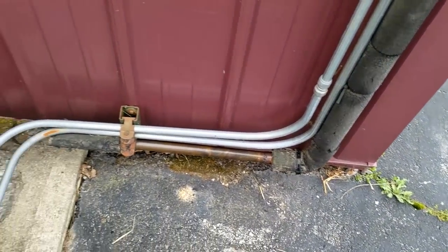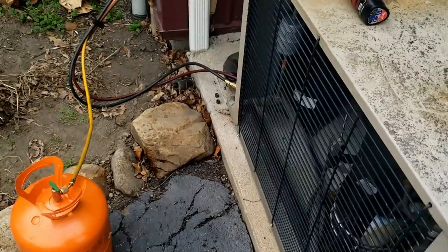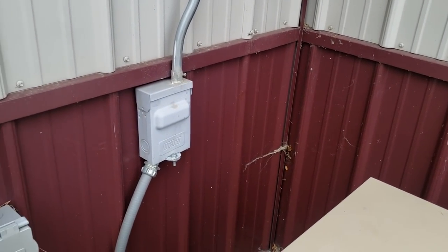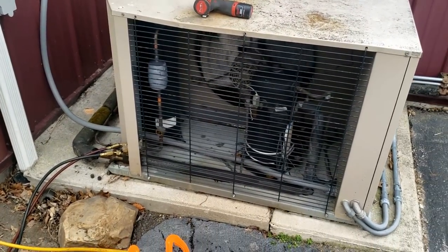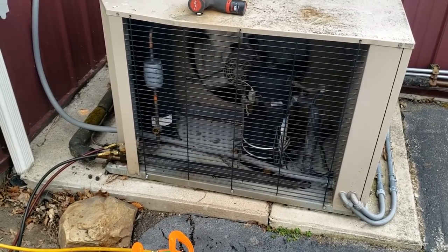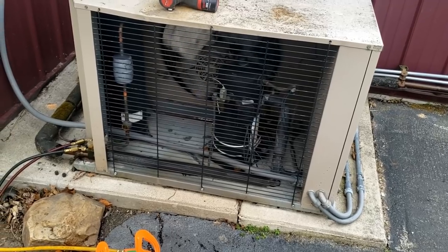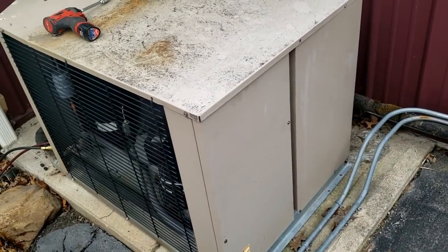Got the line wire-tied up with some big thick wire ties — better than what it was. Checked for vibration areas where the line comes through. I went ahead and put a bolt on the disconnect to keep people from pulling it, but you can still get into it. Sight glasses staying full. Did a pump-down using some heat and my infrared — it's somewhere around 70 percent on the receiver level, so we're good. Box isn't at temperature yet, but the vacuum and preliminary pressure test checks out — both ultrasonic and refrigerant.